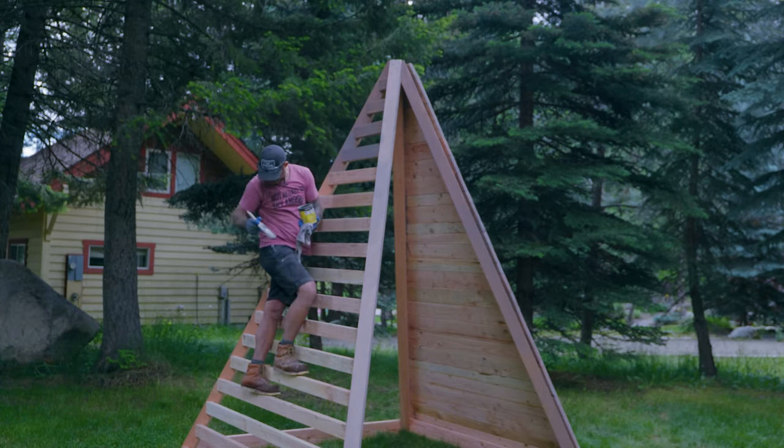So what some of the sauna makers specifically in Sweden will do is at the bottom, somewhere next to the heater, they'll put a little vent, something small, and then they'll put another one on top. And what that'll allow is air circulating from in to out. Basically, as hot air rises to the top and cooler air is at the bottom, the majority of the heat is up high. You'd have to sit on the bench, and if you want to cool down, go below. It works well with kids or people who don't tolerate sauna as well.